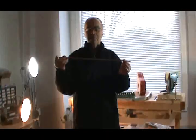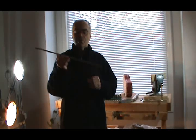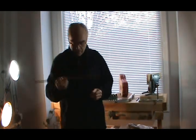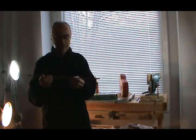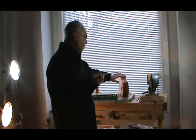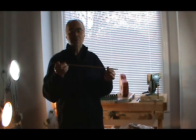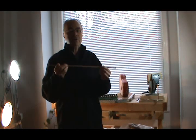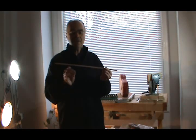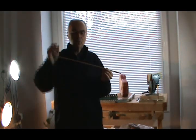Here's more samples. Quarter sawn maple can be used. Any hard, dense hardwood is pretty good for using for your banding and your purfling. Make sure it's hard and it's dense, so it'll bend around the corners when you go to bend it on your instrument. I don't recommend any open pored woods because generally they're very hard to scrape when trying to sand them, and they leave little pockets and undulations in the wood.